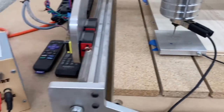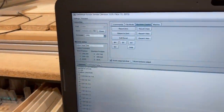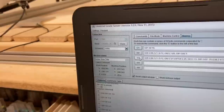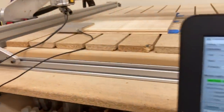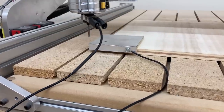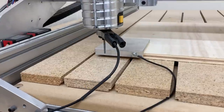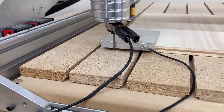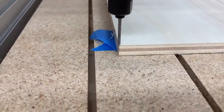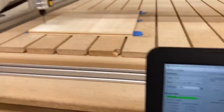I'm using my three-axis touch plate that I made — I just plug it in and use Universal G-code Sender (UGS) with a macro I wrote. You can check out those videos to see how I did it. It only takes a couple of moments to zero the machine on all three axes. Now I have the bit exactly on my X-Y zero position, the file is loaded, and all I need to do is hit send and I'm ready to carve.